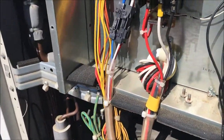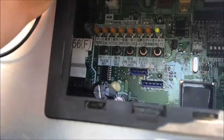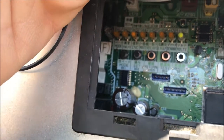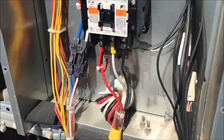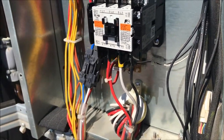So now I got to check and make sure. You can't see it on the screen probably, but the H3P light is on solid, which is good. If the H2P and the H3P light — this light and this light — were both on, that would be an abnormality, as shown right here. So only this light is on — that's normal operation. These two are not on, so that's good. It just went through a check. The new contactor works; we didn't go into an E6 fault.